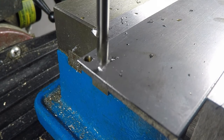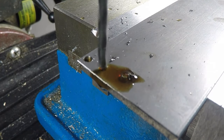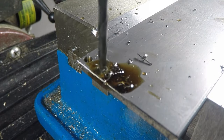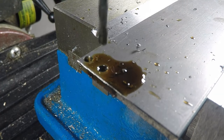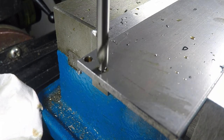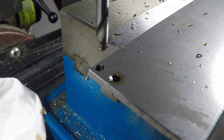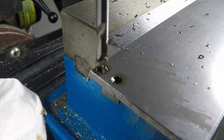That's the spotting drill again and then the regular drill. I'm adding lubrication — this is high sulfur cutting fluid — lots of fluid. I don't want to overheat the stainless steel. Then I'm going to go back in with the spotting drill to put a slight chamfer, which will help the hinge pin push through, because I want a very tight fit and I'm going to have to hammer the new hinge pin in — so it should guide in there a little more easily.